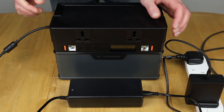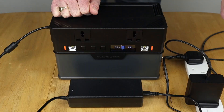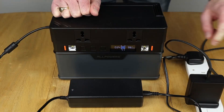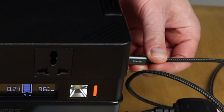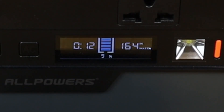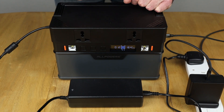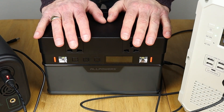Let's plug in the DC port first — this is straight from the power brick. We're getting 96 watts on screen. Now I've got a 60-watt PD charger here, so let's plug that in on top and see what we get. It's settled stable at 164 watts indicated. As you can imagine, that decreases your charging time by a fair old bit. So that's the mains charging method covered — but what about when you're out and about taking advantage of 12-volt charging?